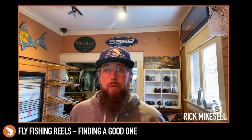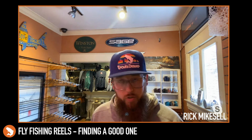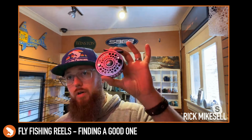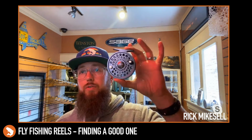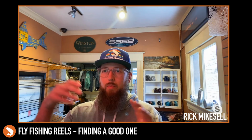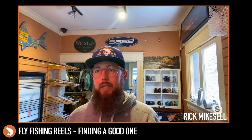So in Orvis, the first couple we're going to talk about is the Battenkill bar stock and the Battenkill disc. Battenkill bar stock is a machined bar stock aluminum reel for $100. This is the only one I know of that's going to be machined bar stock aluminum for $100. There's lots of other cheaper reels out there that are aluminum, but they're cast aluminum. And cast aluminum is molten aluminum injected into a mold at high tolerances and temps, but way lower than that of bar stock. So as such, there's little fissures or air pockets that can form in the reel.